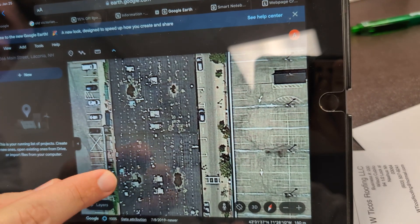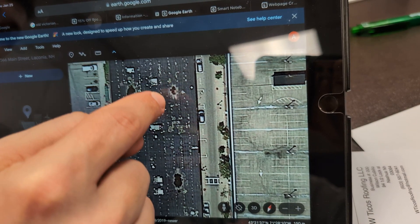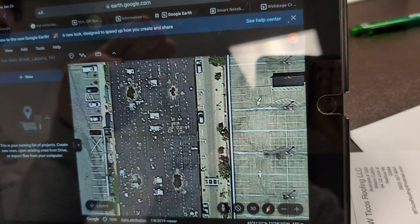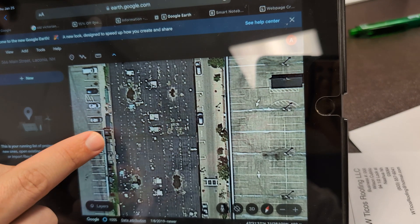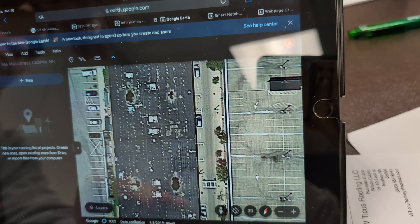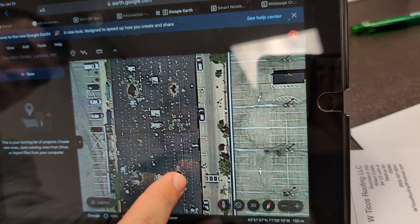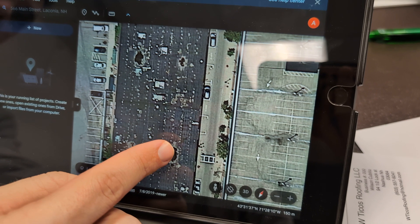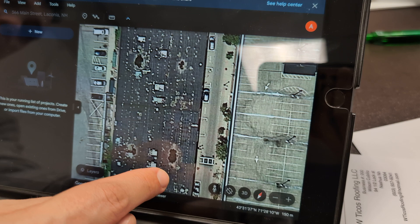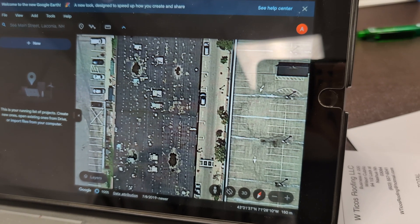You want this zone to flow to this spot, all this area to shoot to this spot. You're basically tapering the middle and raising all the exterior walls higher, so everything flows this way, everything flows that way, then everything flows in. You need to do more mapping before, because what ends up happening is you get stagnant stuff here. With a heavy rainstorm, everything on a one-inch slope might just start flooding, running every which way, finding whichever holes it can get through first.